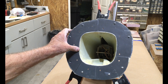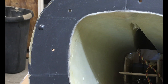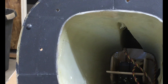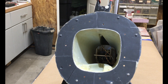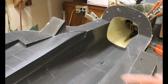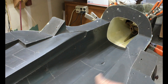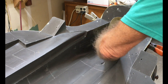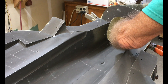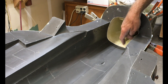I've got that cut — it's a little proud right now, needs a little bit of splice. I'm going to add the other section on so you can see what I'm about to do. This is the top of the mold. Once it's all wax-prepared, I'm going to lay this entire section up as one and lay it up into this section, so I'll have a nice heavy-duty seam cloth around here.